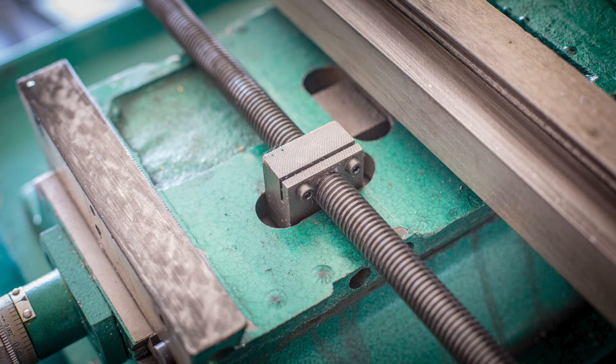In this picture of the x-axis lead screw nut, you can see the two cap screws that are used for backlash adjustment. My mill had about 20 thousandths of an inch of backlash in the x and the y axis. I never did bother to search out the cause and sort it out.